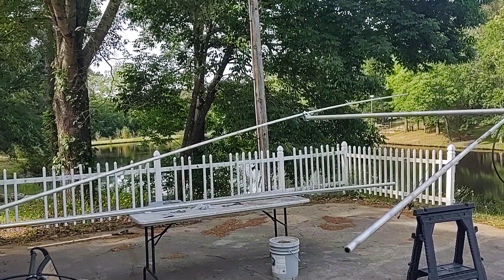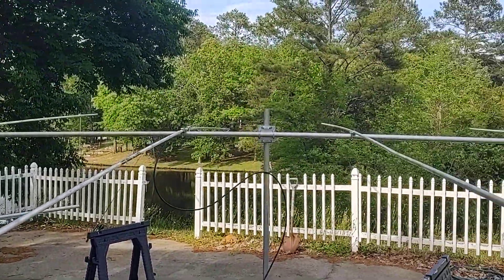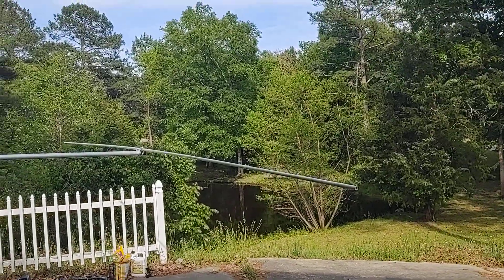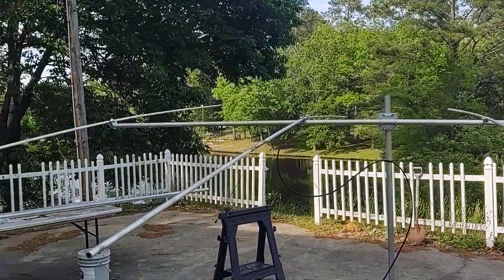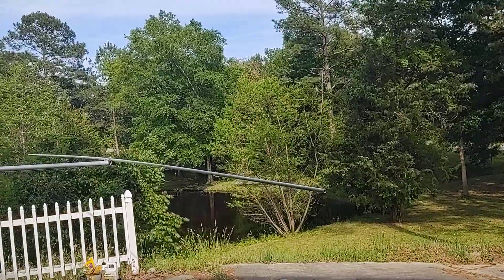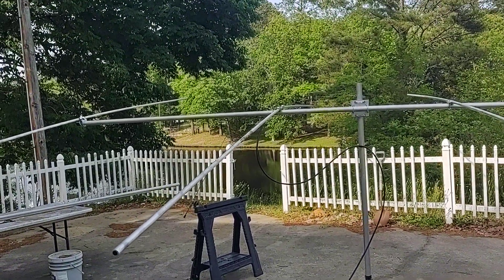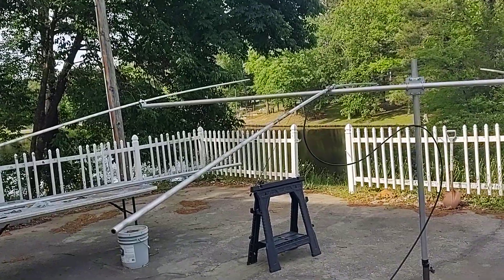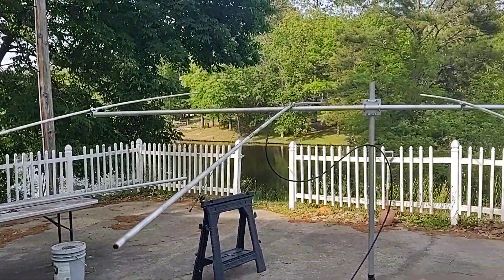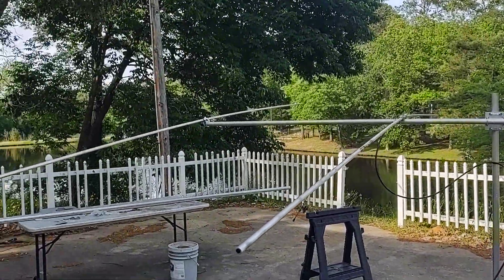AudioMan288 was using half-inch tubing, but I couldn't get the lengths I needed so I went with three-quarter inch. They're a little heavier than half-inch but it doesn't hurt — you've got heavier wall, more metal, more radiated material. Typically with a manufacturer like Mako the elements max out around seven to eight feet for shipping purposes, so they give you a five-eighths center section with half-inch ends that slide in. These are really solid — it's kind of a beast for my first one, and we've already tested it and it's working well.